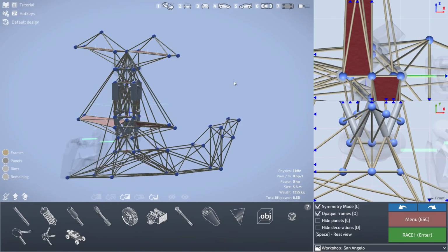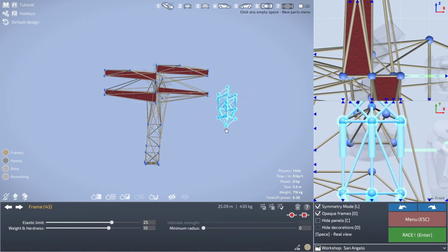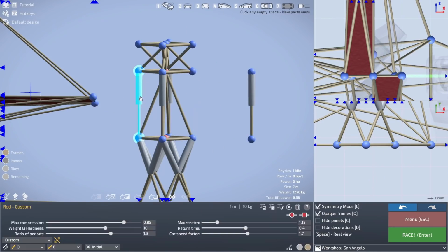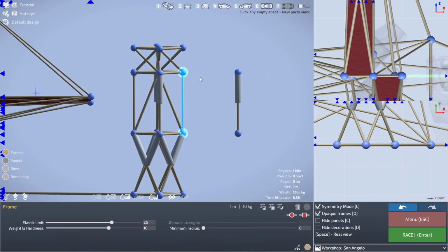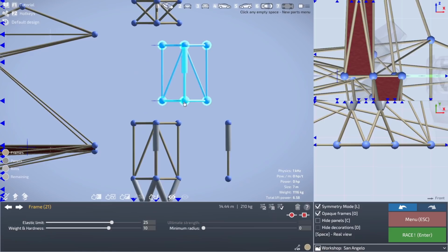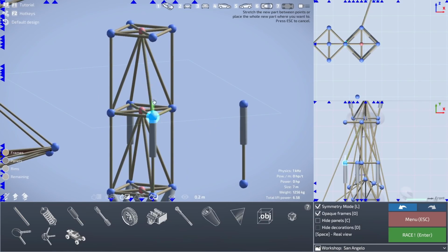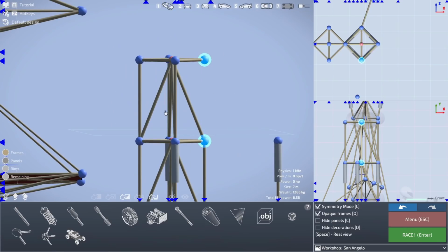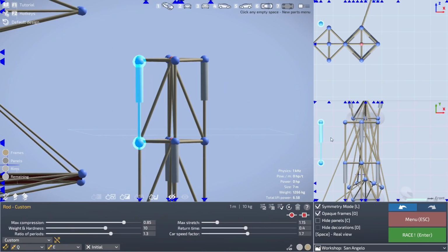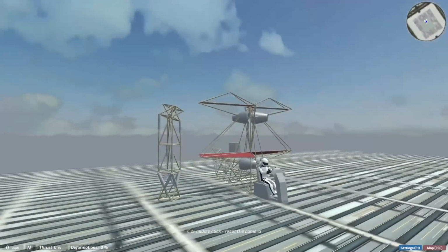So unfortunately that wasn't going to work, so I had to pull the swash plate back out and actually fix it. But fortunately I did know what I wanted to do, and that was separate out the forward-backward tilt mechanism from the side-to-side tilt. And this is going to allow me to secure each of those 2 mechanisms better, and they should not be able to swing from side to side and do what we were seeing. So I separated out those rods and then put them in place here, and then finally put on the top part, which allows it to rotate freely. And it still seems to work.